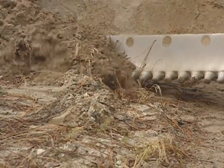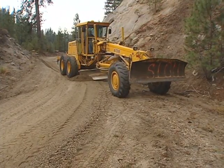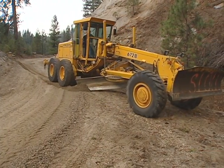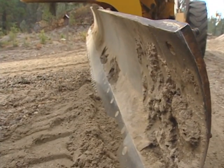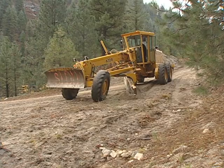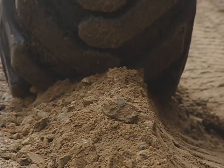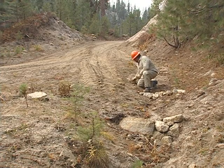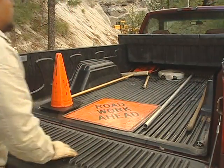Position the mold board adjacent to the ditch and make a cut no deeper than 4 inches. Cut the dip at approximately a 30 degree angle to the road center line. Then pick up the mold board and back up the grader. Reposition the mold board until the toe is in position to resume cutting, and continue until the dip is completed. The resulting small berm is placed downhill from the dip and is rolled and compacted with the grader's tires. If the dip outlets onto erodible soils, protect the ground with riprap. Now you're ready to remove your control and safety devices.